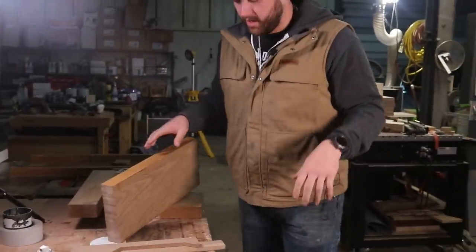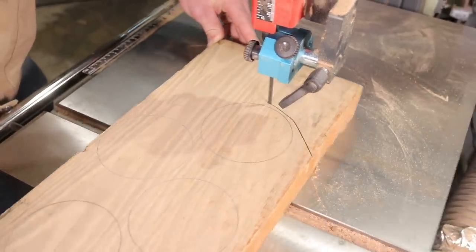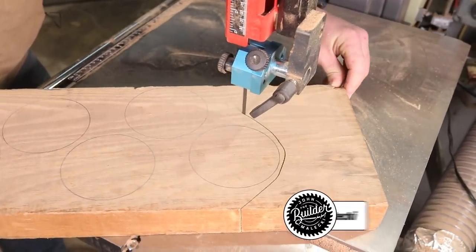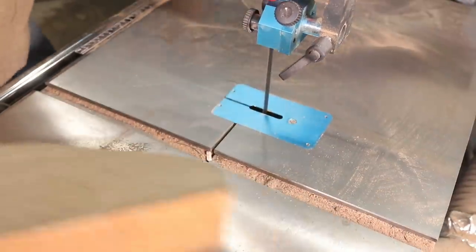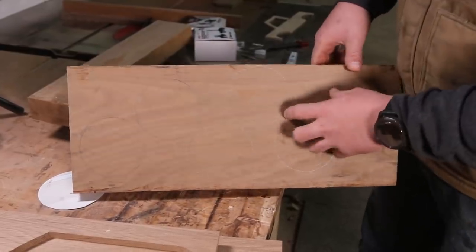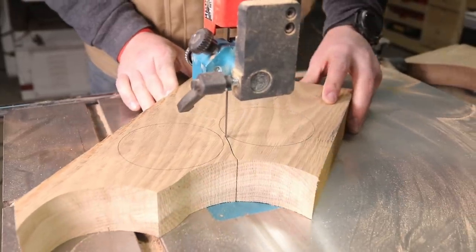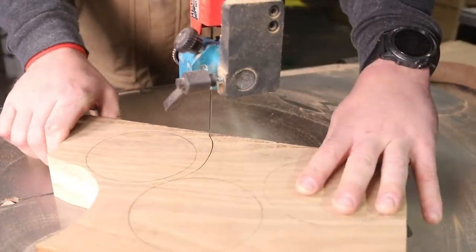So as things typically go, had to pivot here. CNC, I have too many updates on my computer because I had some computer issues. If you guys follow me on Instagram, you probably saw that, and if you don't, follow me. But, so what I did was I outlined each circle for the wheels on this piece of white oak here. It's about 2 inches thick. I'm gonna rough cut them on the bandsaw, and we're gonna put a little jig together real fast to get perfect cuts on the bandsaw as well.